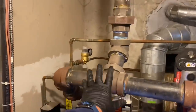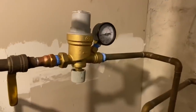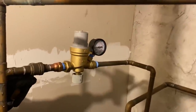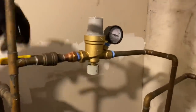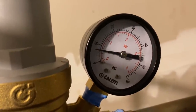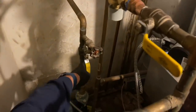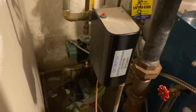That really came out nice when we did this a while ago, over 2 years ago. Now it would be in MegaPress. Yeah. All right, our new pressure gauge is in. Let's add. Want to close that? Yes. Okay. And let's check out our pressure. Okay, what does that say? A little under 10, no? It's 8. It's a little low. That's interesting. Let's open up that. Okay, now we'll turn power on and let's raise the thermostat up for the basement zone, and then we'll purge if we have to.